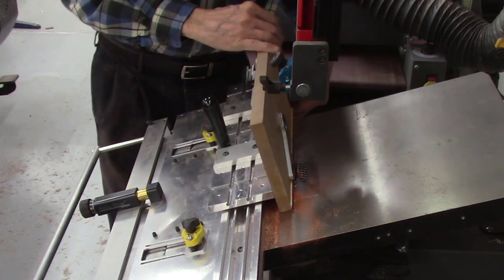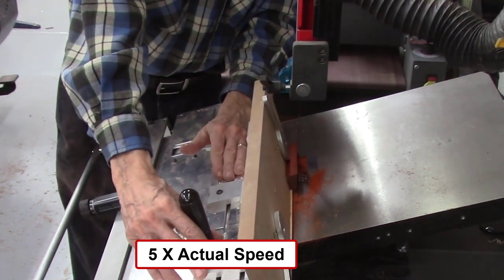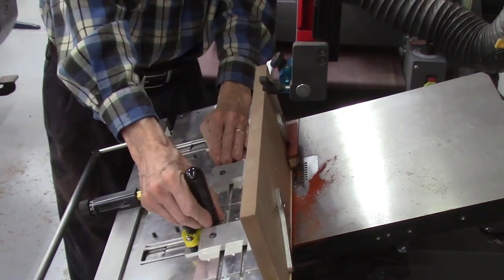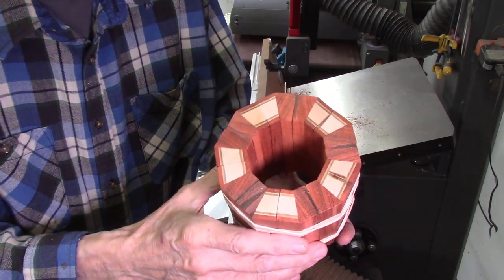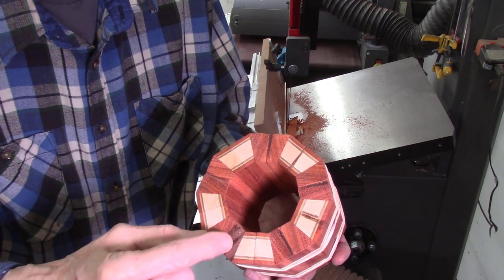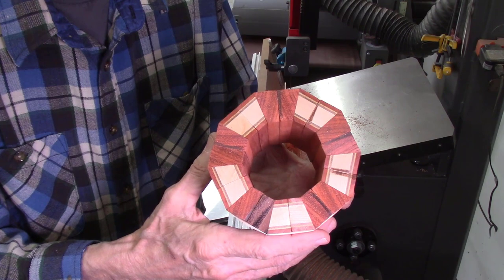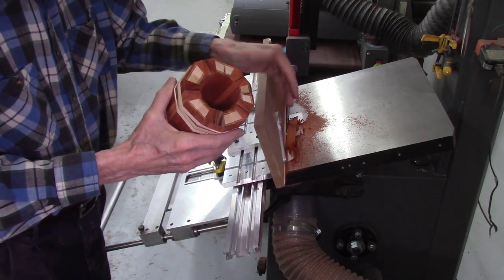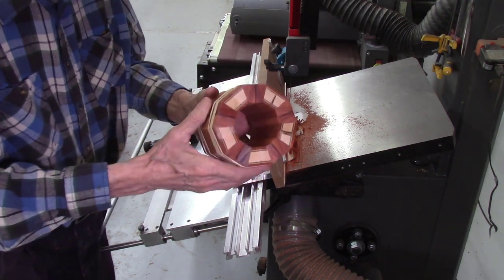The re-trimmed wedges will be a little bit smaller but they'll work. Using a single clamp I slice a small sliver off each side of the boards and get a perfect 18-degree angle. Then I proceeded to recut the remaining staves. I discovered that the segment count had to be divisible by 4, which is why I had to go to 20 segments — 5 of each type of stave. This was a useful discovery: if your angles are off, you can recut one board at a time, and all boards end up cut on the exact same angle in the same position, so they're all identical.